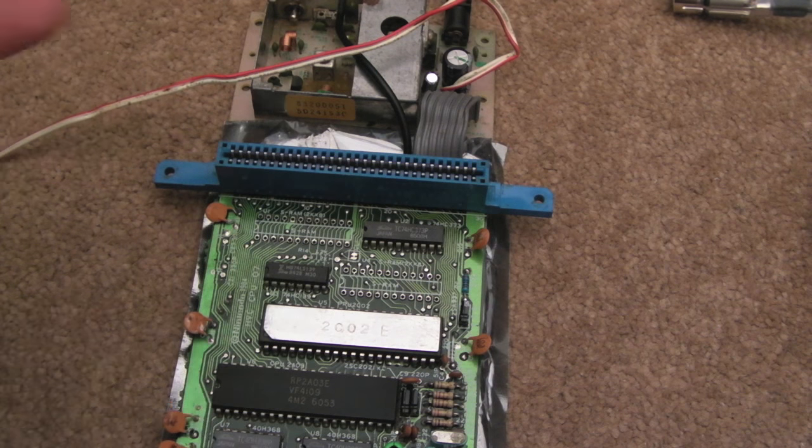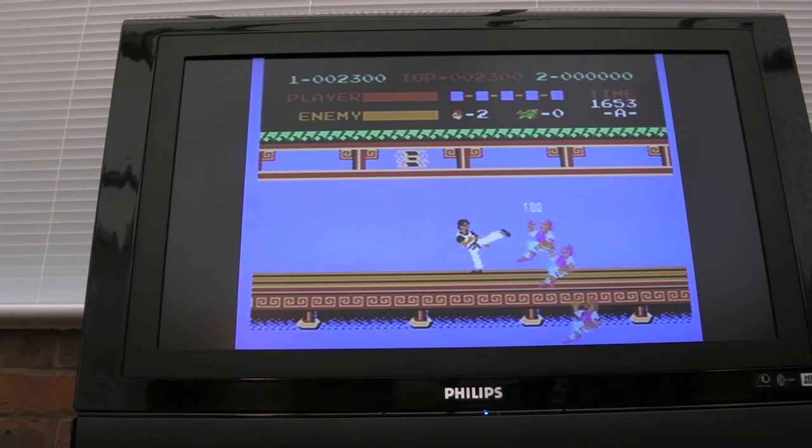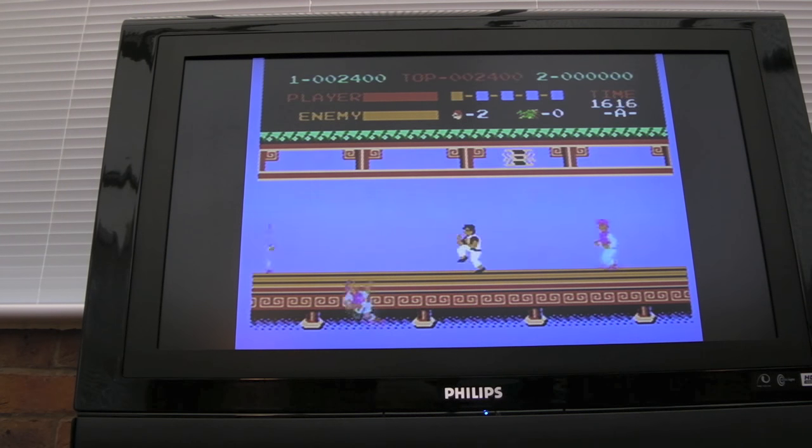There's value in just showing you what happens when you've got no SRAM — you just get a grey screen. So if you ever get a NES or Famicom that gives you a grey screen, your SRAM — particularly the program SRAM — is most likely the cause. On the NES, the first thing to check is the cartridge slot. But on the Famicom, you get a grey screen, it's going to be a RAM fault — nine times out of ten it's going to be an SRAM fault. Anyway, I thought you'd find that interesting. Thanks for watching, I'll see you soon.